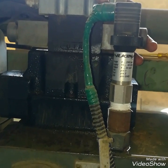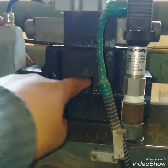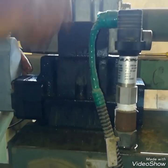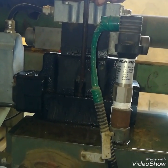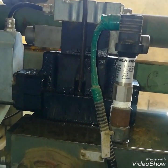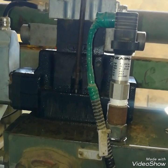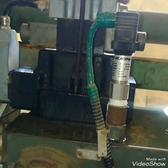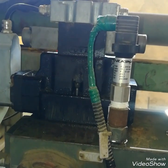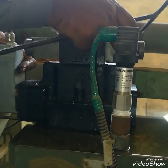Now I will remove the two in the center — one is in front of me and the other is on the opposite side. Here I am removing these bolts. I will show you how to service this DC proportional valve made by Parker, Germany. Its supply is 24 volts, and it has a set point and a feedback.